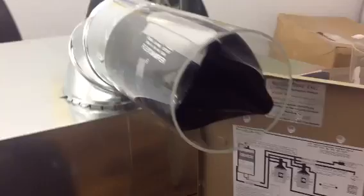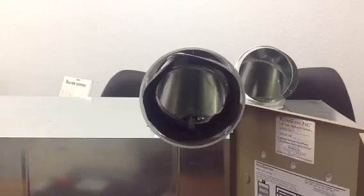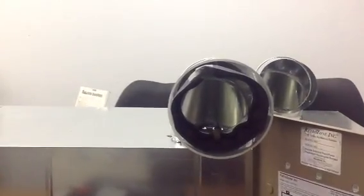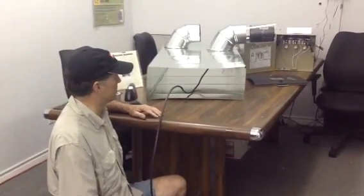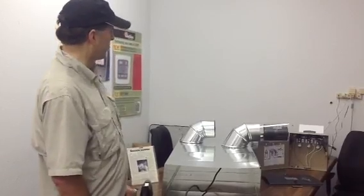Now I'm going to disconnect it and show the under-vacuum deflation. That damper is installed and ready to go. It's time to move on to the next damper — it's a very quick, painless process to get it in there. Then it's just a matter of matching up the tubes, hooking back to the solenoid panel and pump, which in turn will hook up to any 24-volt AC zoning system, and you can enjoy the benefits of zoning in your home and get rid of those troublesome cold basements and hot upstairs. Thank you. I'm Jerry Tartolino. This is RetroZone, and this is the method for installing our flex dampers above ceilings that have been sheetrocked. Thank you.